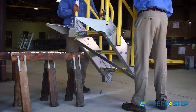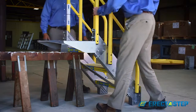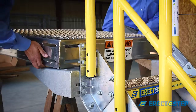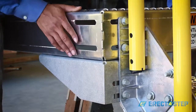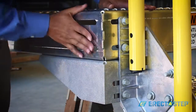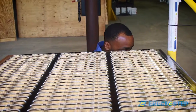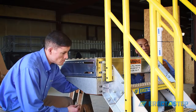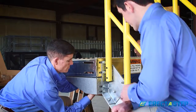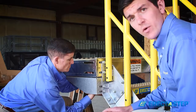We will now set up the temporary supports while we install the stairs on the anchor points. Now that the stair unit is in place and bolted down, we will install the platform. Connect the vertical face of the stairs to the vertical face of the platform using bolts inserted through the stringers. It is necessary to use a backer plate for this connection — failure to do so may cause the equipment to fail and result in an injury. You will also need to connect the platform to the gusset bracket with two bolts through the bottom holes of the gusset and platform. Make sure that the gusset and platform are aligned correctly to avoid damage to the system.